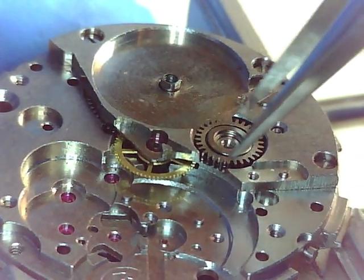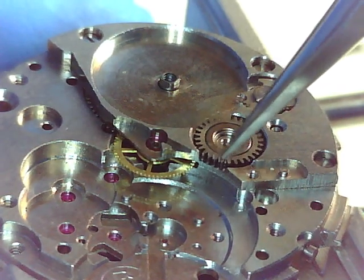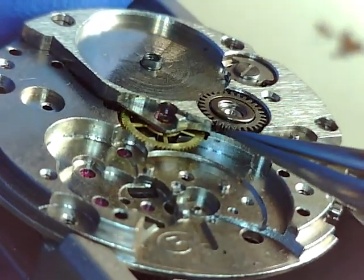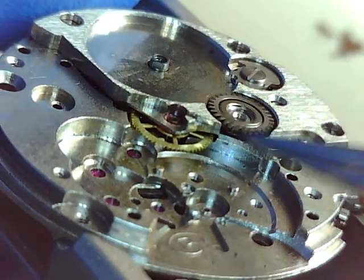Here is a wheel — I don't know what that's called, a winding wheel, yeah let's call it that. That's going to come off. Those are reverse threads — notice I'm turning it clockwise to take it off. Usually a screw would indicate reverse threads with a slash or a line milled across parallel with the slot, to let you know that is reverse threads. So instead of righty tighty lefty loosey, it's actually righty loosey lefty tighty. This is a two-piece bugger — it's being a mule, which is good because that means it's a precision fit.